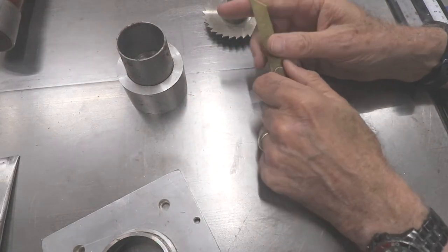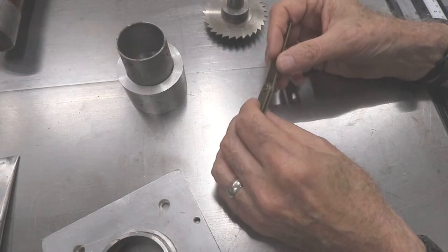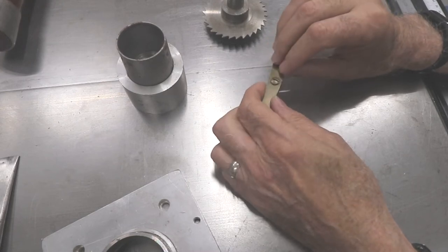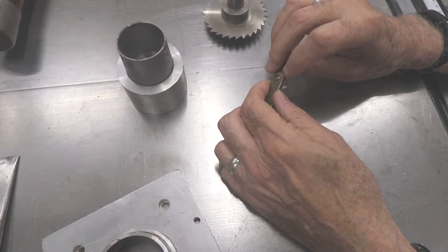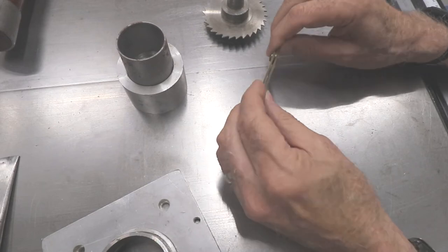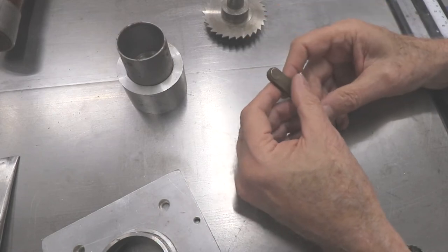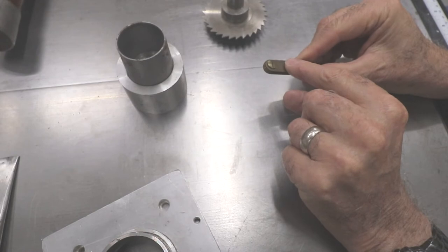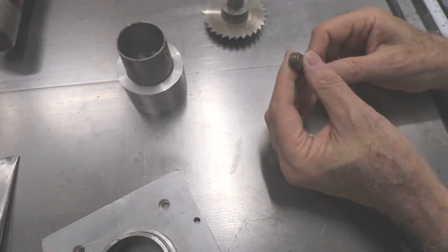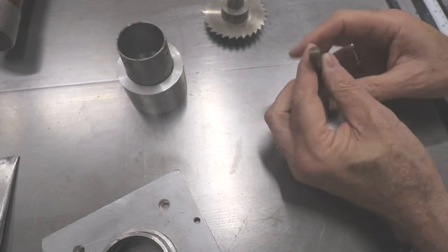The blade is really simple. I just cut a 45 here, and I put the whole thing together with a snug-fitting barrel bolt, where the barrel goes in here, the screw goes in here, and I've got some plastic capped on in there as a little bit of a friction reliever. So that goes together, and at that point I've got a double square at both ends. Then another jig, where I would stick the blade and the body in through that hole and rotate it up against a milling head and move it in slowly with the vise, and I would round that head off until I have the rounded end right here.